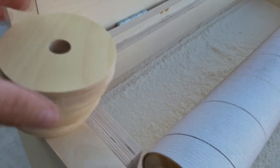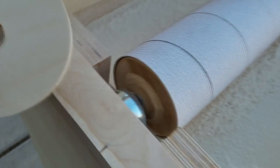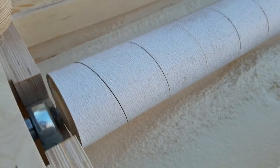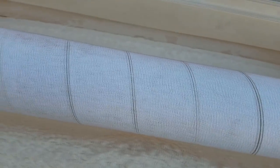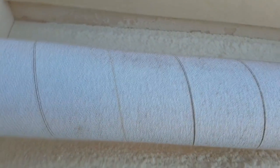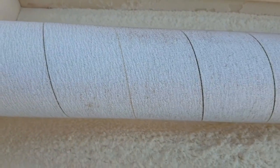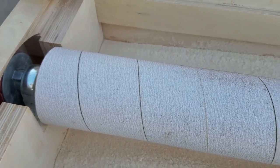The drum was cut on a CNC machine out of little wheels like this. They were real quick to cut on the CNC machine. You can see they have a 5/8 inch center hole, which matches the size of the stainless steel shaft that goes through the drum. I set the diameter of the part to be about three to three and a half inches — if you make them too big it takes a lot of sandpaper to go around it, so three to three and a half inches was a good size. I had this stainless steel shaft that runs all the way through, and I just fit those round pieces onto the shaft, slid them on, then put a few drops of glue in between them so they would stick together just a little bit. They don't have to be firmly stuck together and they really don't need to be attached to the shaft itself — there's not that much stress on the drum. I've never had any problem with the pieces pulling away or becoming loose.